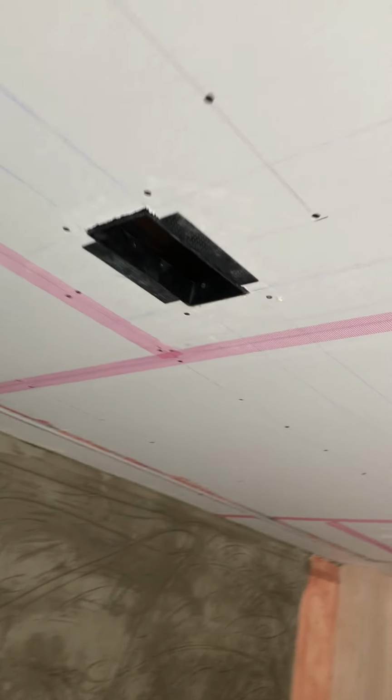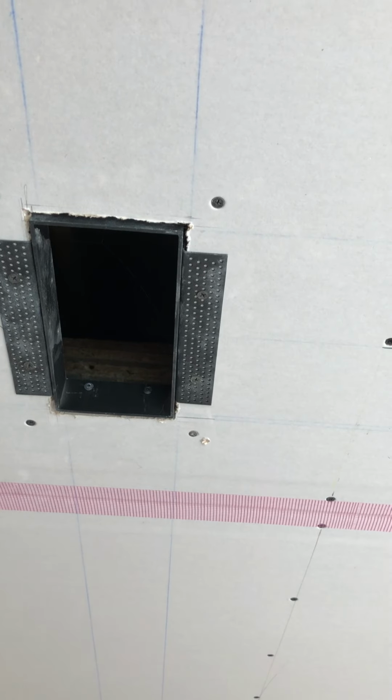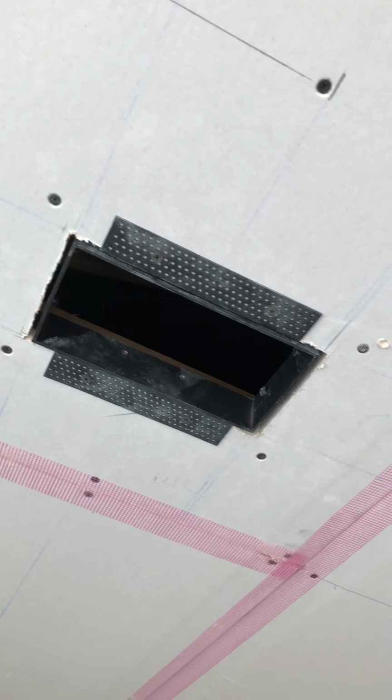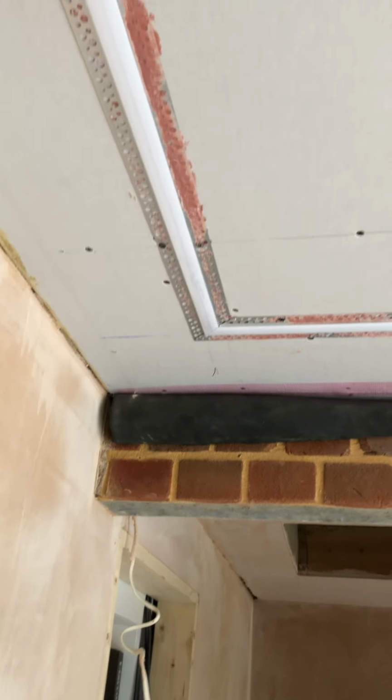We've also got plaster in downlights, so we've got metal fittings, twin GU10 downlight fittings. The customer really liked the black finish. Make it stand out less. So I'm just going to wait for plasterers to come back, to skim the ceilings, and then we'll be back in here to cut and fit our LED strips.